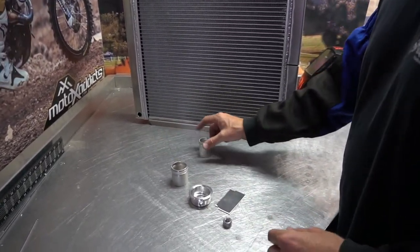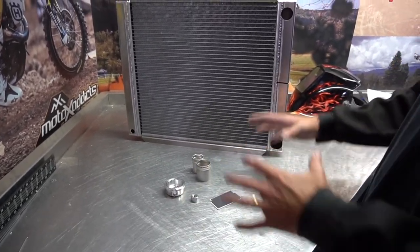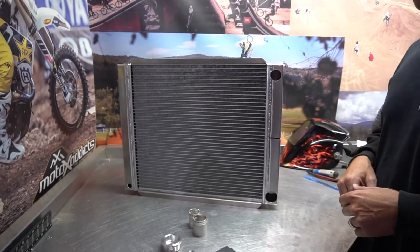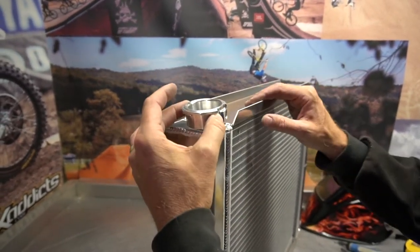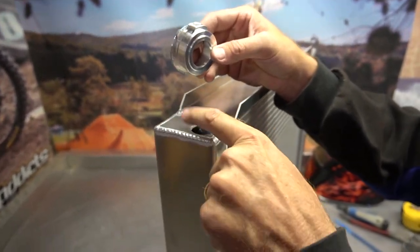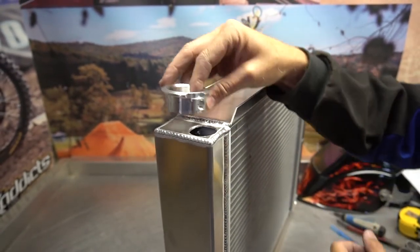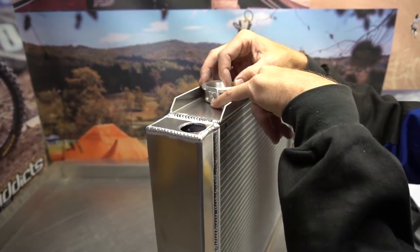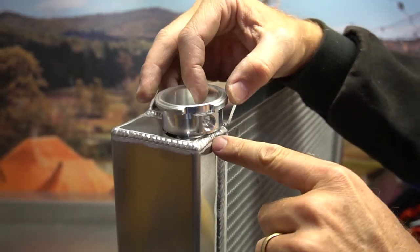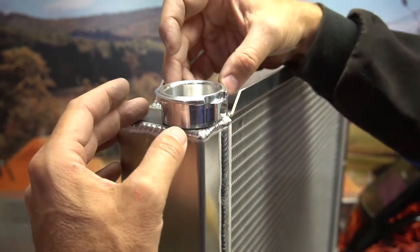To finish the radiator, we've got the inlet pipe, the outlet pipe, the filler neck, the drain cock, and the baffle. All the holes are cut and the baffle is cut in — we've got to weld it. We're going to tack the filler neck on. Notice the offset that we've done on the hole — that's to get the hole up close to this edge so we can weld underneath the thread. If we offset the hole close to the edge, we can rotate it and weld under there very easily without threatening the threads.